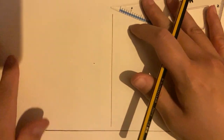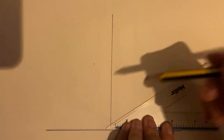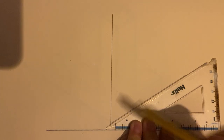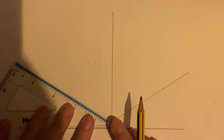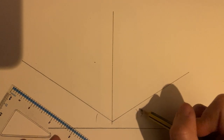Then from that point you will need to draw the parallel lines. The parallel lines are ones going at a slightly diagonal angle, and what you should be aiming for is a 30-degree angle. The set square here has that 30-degree angle, so you just switch it around and draw your other parallel lines — these are obviously at 30 degrees.